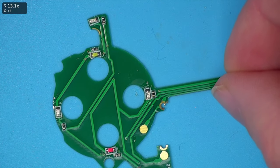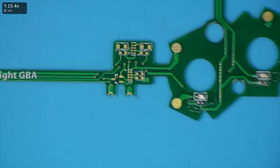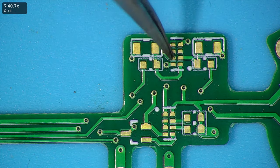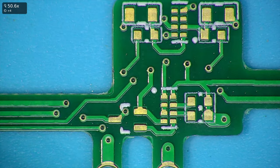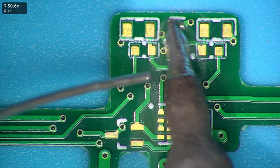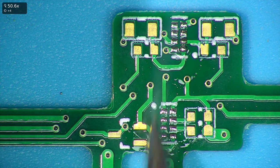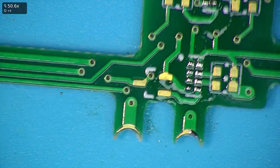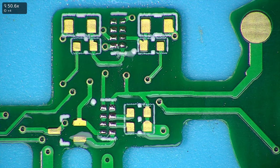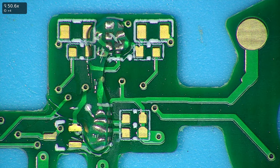So now we have the LEDs and the resistors — I've just scattered random colours on here. The only area left now is to focus on this control area. We'll start with these two DFN chips, these fine pitch chips. They're not that hard to solder but you will need a hot air gun. Basically just take your solder first and cover the pads, get them all tinned, then clean off the used flux and apply some fresh flux over the top. We'll start with the top one — the NOR gate.